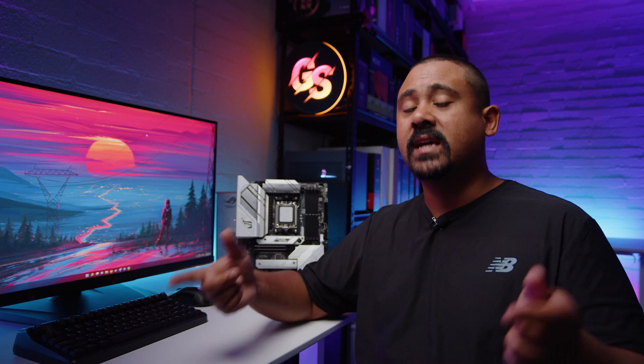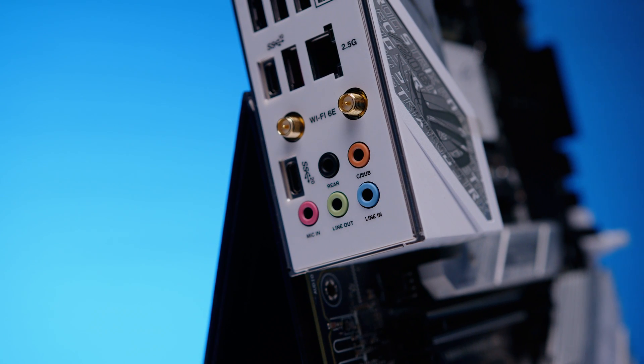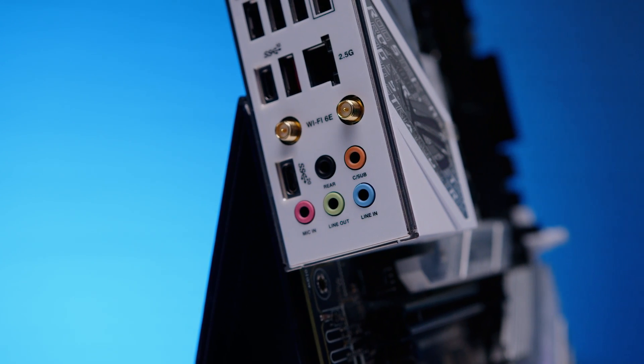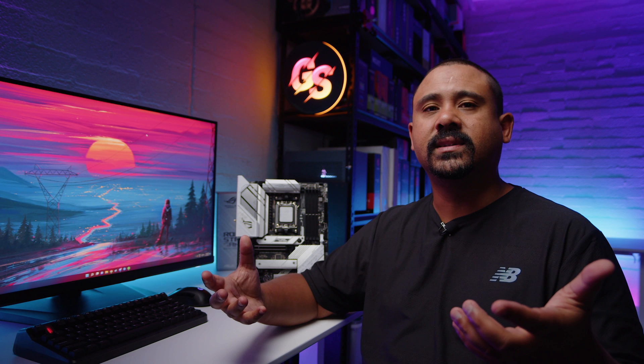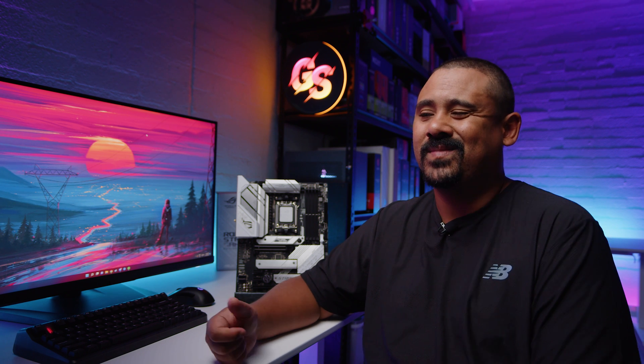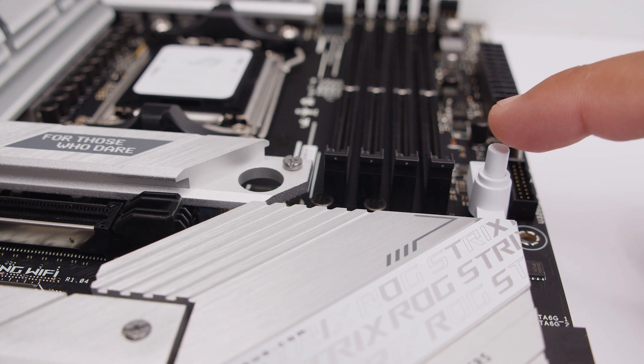Alright ladies and gents, I hope you enjoyed this overview of the B650A Gaming Wi-Fi from ASUS. This board is one of those aesthetic boards that has quite a large feature set. One thing I noticed is the audio interface — it has regular 3.5mm jacks but there's no optical or SPDIF on this board. I would prefer it had optical in case you were building a home theater PC or using something like SteelSeries headsets that use optical for high-fidelity surround sound. So it's a bit disappointing that this board doesn't have it. But what it makes up for is having this little button for releasing the PCIe slot.